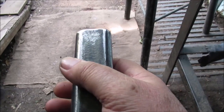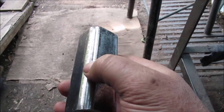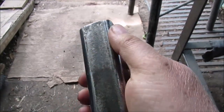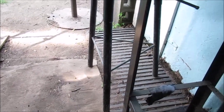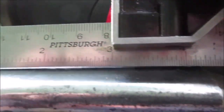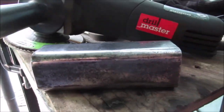That is a 60-grit flapper disc — 36 grit is just too rough. It's still nice and shiny and pretty. This is probably going to be painted, but I don't know the dimensions yet. I want at least four inches long — it's about four and a quarter. My vise jaws are four inch, so this might be something I'll set in my vise at the drill press.